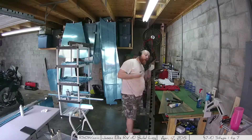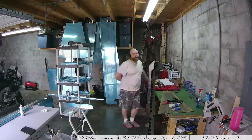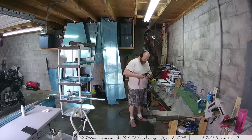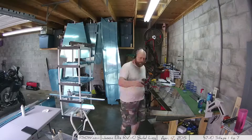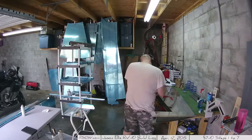This is me working on the top rib — I'll put the counterbalance rib on shortly. It's been so long I'm having trouble remembering the sequence. Now I'm doing the squeezers on the bottom. This is step five: you have to rivet all of the skins to the rear spar we just put in with the blind rivets.